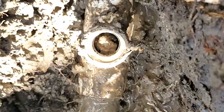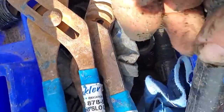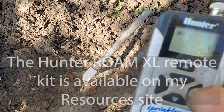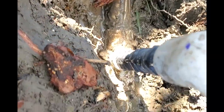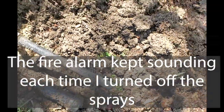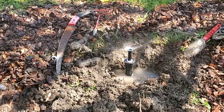There is mud down in there so I'm going to have to flush that out. I'll see if I can get that out with the screwdriver or the needle nose and then flush it out. To flush it out I'll just use a combination of risers that I have in here already with an elbow so it shoots it out away from the hole. We don't see any water coming out down there, so that's good — hopefully it was just that riser. And this is working fine, there's no more water running down here, so that was apparently it. Just a broken riser — now everybody's happy.